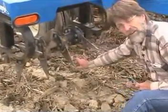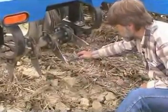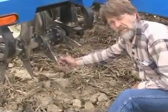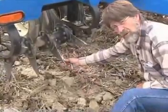This tip of the tine down here is the propulsion face. This contributes to the actual forward rotation of the shaft as it goes down into the hole. It creates a rotational force.